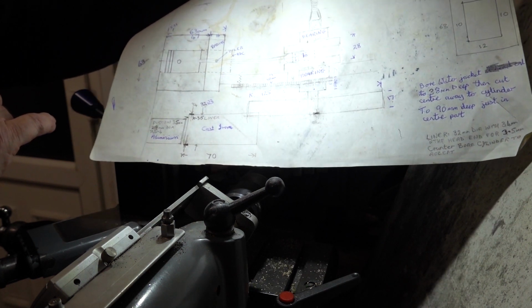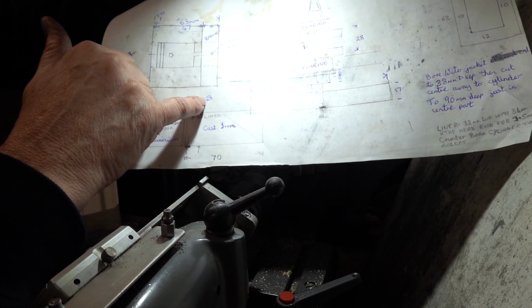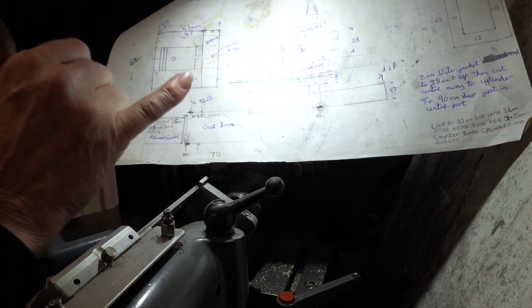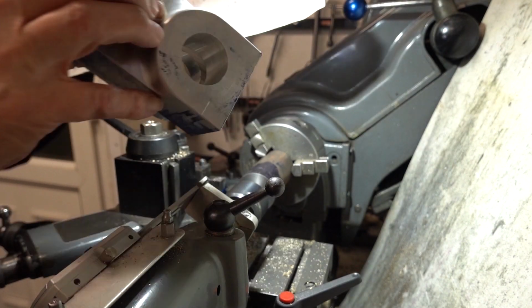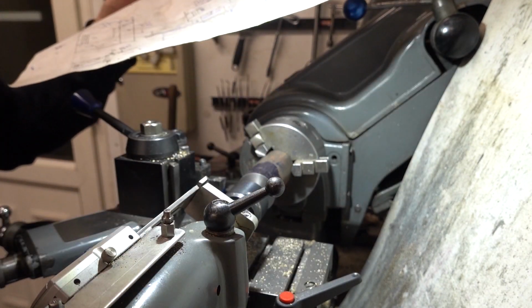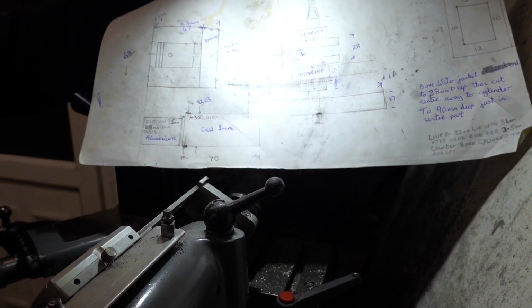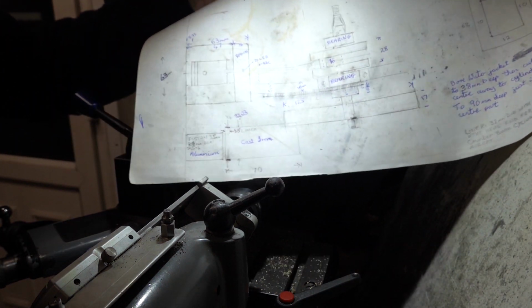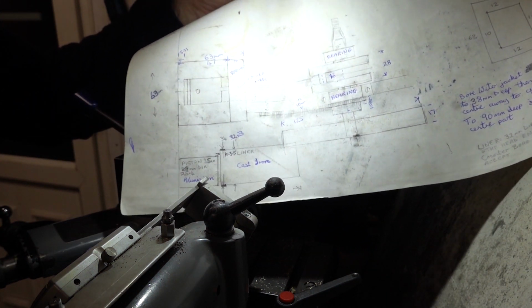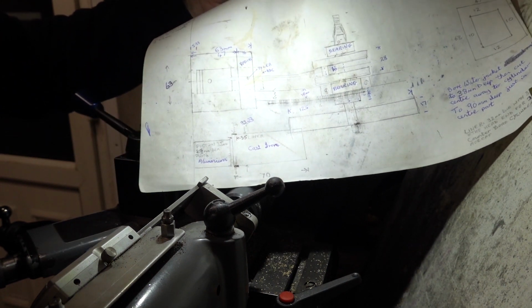Why I come to that I don't know, because the piston's 25.4mm. So where I got that figure from, not quite sure. Oh, I do know why. Because when I bored the cylinder, one cylinder, that's the cylinder bore size, 32.23. So if I make that 32.23, it'll be a press fit. And with Loctite and in the press, that should press in fine. Be careful, because if you start pressing something into aluminium and it picks up, you've had it. So be very careful.